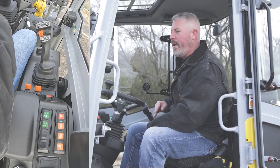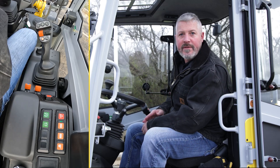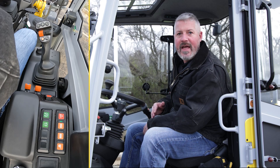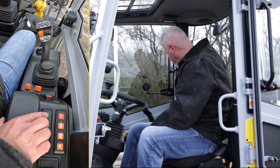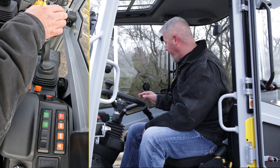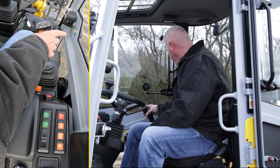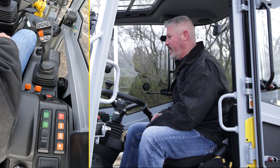Let's start with the most basic mode, which is auto mode — let's call that your standard operating mode. When operating in auto or eco mode and you want to run a continuous flow attachment, the first thing you're going to do is activate that third circuit continuous flow by pressing this switch in the cab. You'll get a flashing green indicator, then select your direction of work, and that will lock in continuous flow.